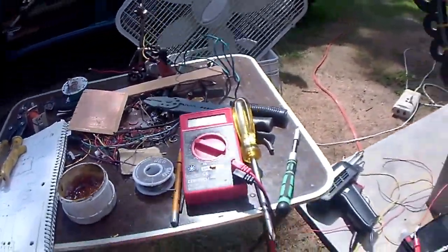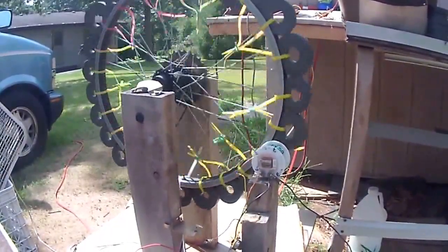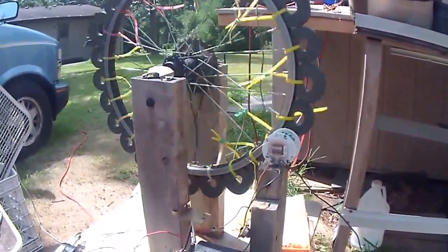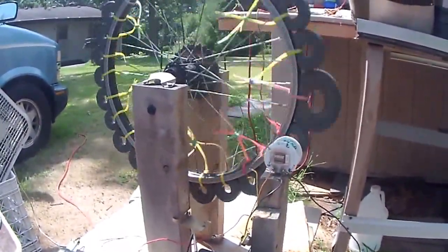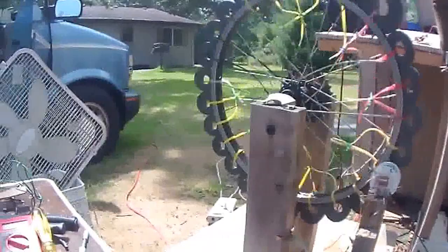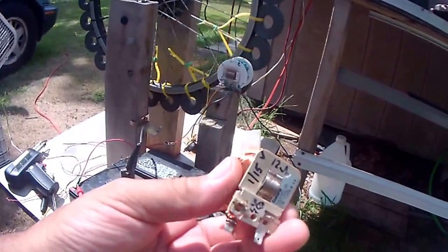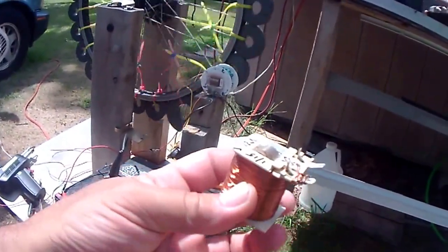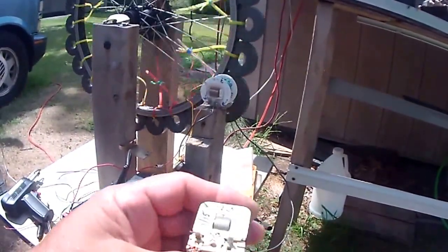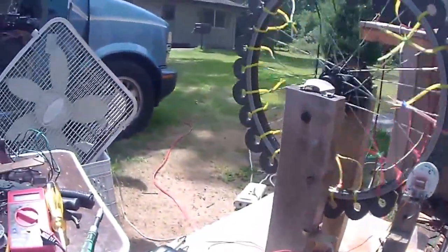So yeah, this is just a tiny coil, 6 ohm and a 34 ohm. The trigger's 35 ohms and the charging coil is about 10 ohms of wind. It doesn't matter if you do bifilar or one at a time, it doesn't matter to me. So here's an experimental one. It all comes from those fans in the microwave ovens. Good coils to use, good wire, and you can even use the laminated insert soft iron cores in there to pulse. It pulses well with that.